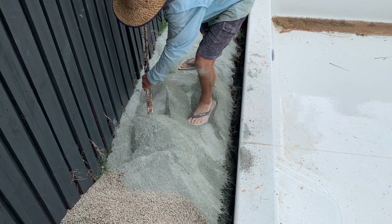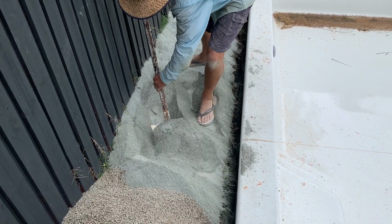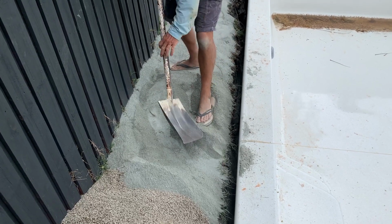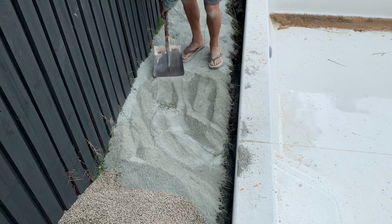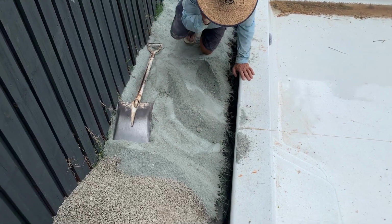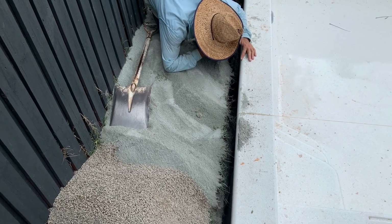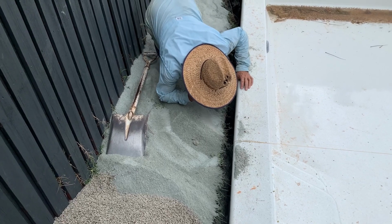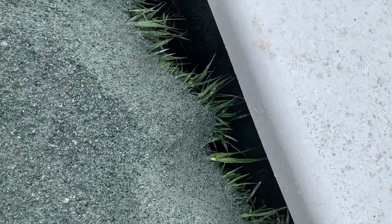That way, if the walls start to fall in on your excavation, the most important part in terms of getting your levels right, meaning having the right backfill material right on the bottom part of the pool, underneath the pool slightly and right around the curves, is going to be cement stabilized backfill, which is exactly what you want. You don't want to have a whole heap of sand or mud or rocks or anything along those lines, which over time is going to shift.